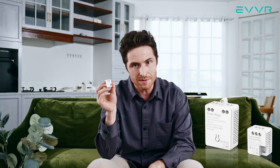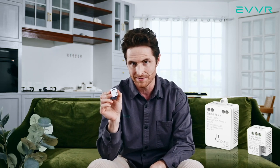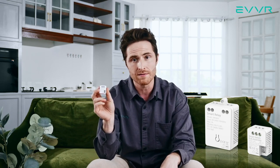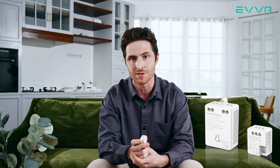For the smart switch sub-assembly, this installs near the mechanical switch for the light itself. It's incredibly small and compact, needs no neutral wire for installation. Two of these can fit in almost any electrical box, which means this supports up to four gang wall switches.